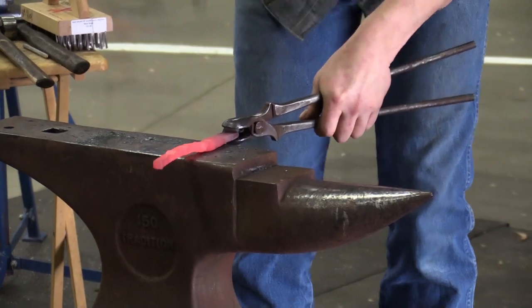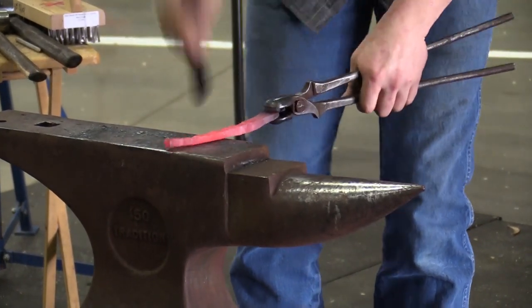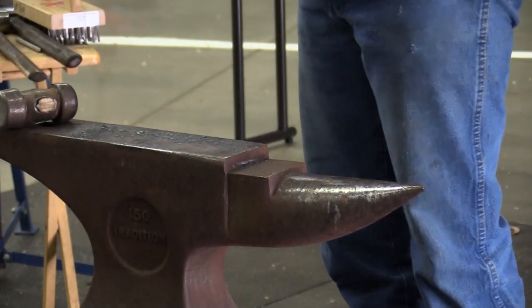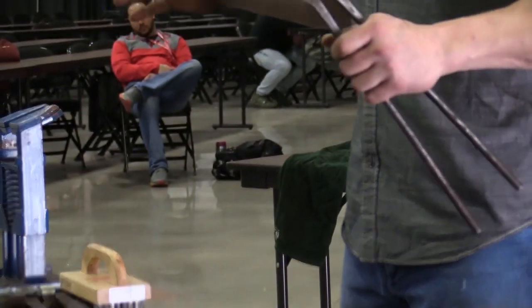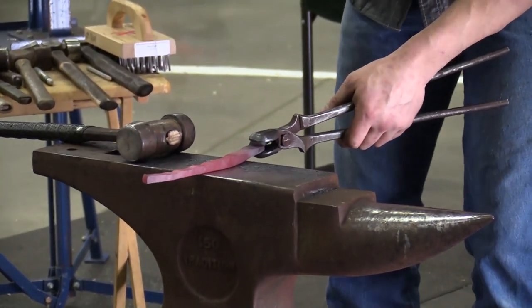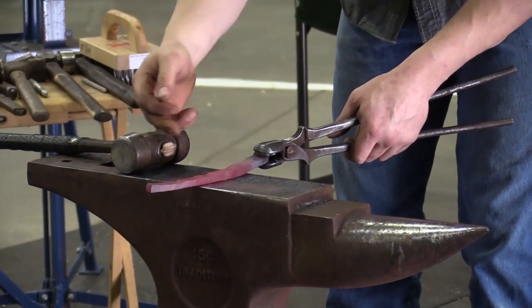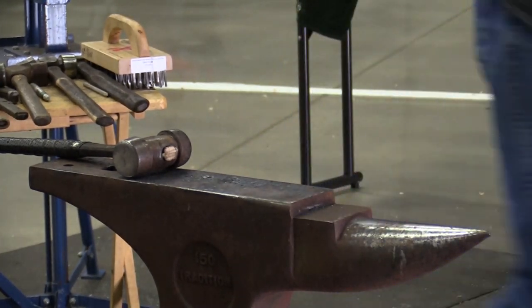Now a quick flat, filling all the gaps. I know that seems like a weird thing that those gaps can be filled, but if you watch a body shop guy, they have things called shrinkers. They'll grab on a metal and pull it together. So when our hammer hits two mounts, I think there's a little bit of that happening, where it's pulling it inside of there, where it can't get past the hammer, where the mounts are there, and so it goes ahead and fills your gaps a little bit.